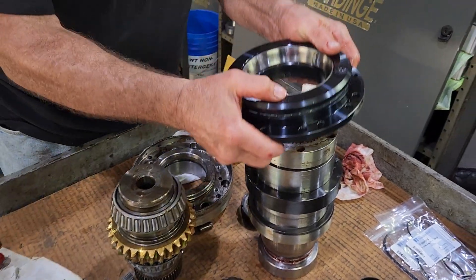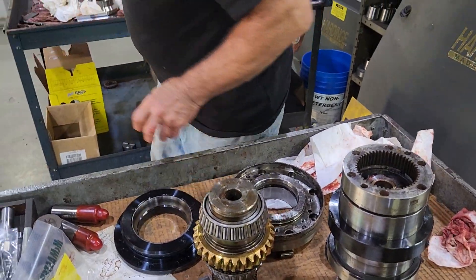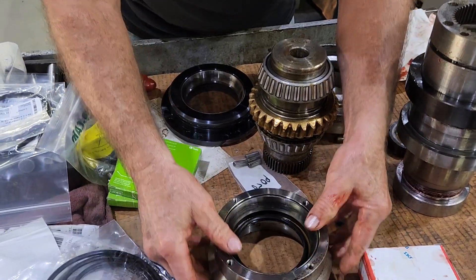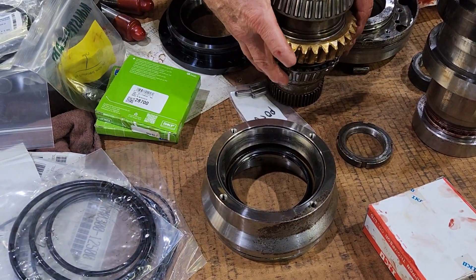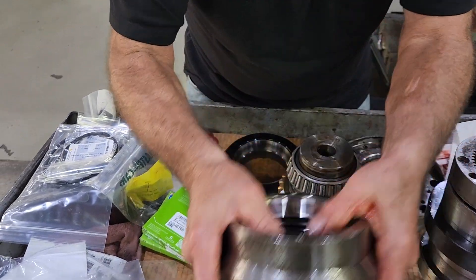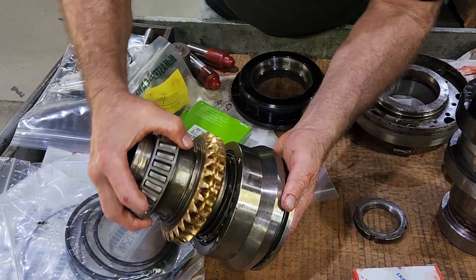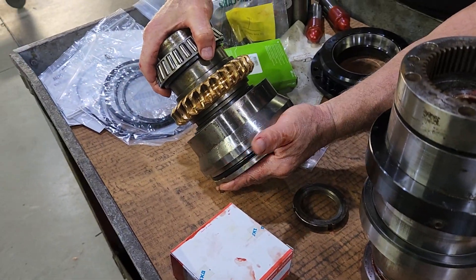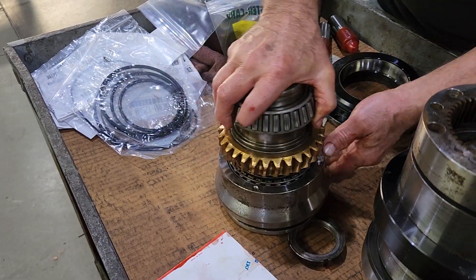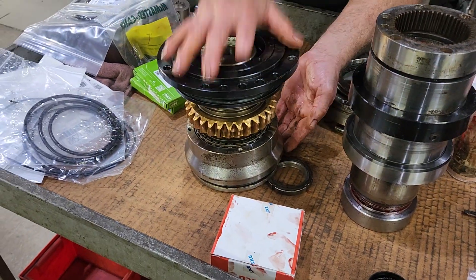This is the other one — this is the cap. Here's what this detail looks like put together. This goes into a precision bore, and all that's holding it in there is that O-ring. It goes into the machine like that and tightens up. To disassemble this, all you do is use two slide hammers and this detail comes out. This back plate preloads this — just a taper. You've got braces on these. That's that assembly.